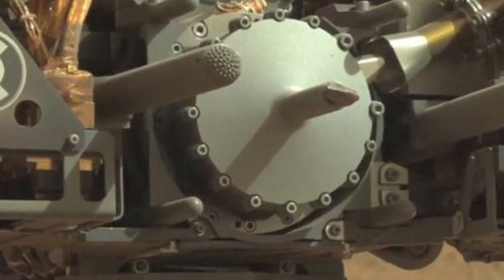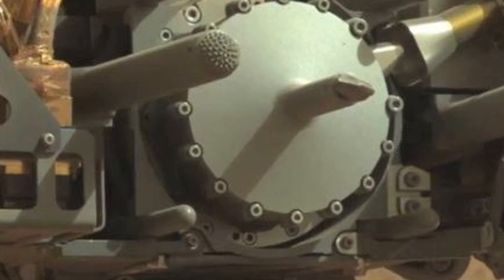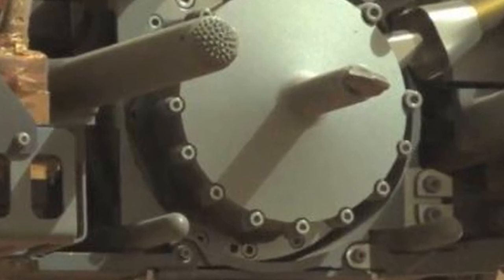The percussive element basically goes bang bang bang bang into the drill — just like if you took apart your hammer drill, you'd find a moving coil that goes back and forth and whacks away at the chisel. Because we call it a drill but it's really a rotating chisel that carves away at the rock. That's why it's so effective — it doesn't work well if it doesn't hammer. So we need to get that working, and that's what we've been focused on these last few months to get ready so we can actually drill a rock.